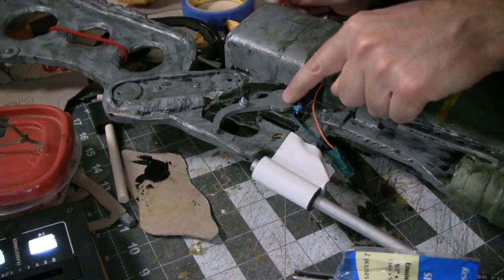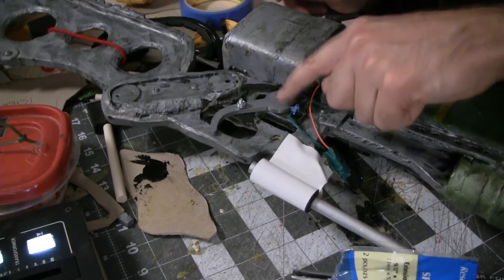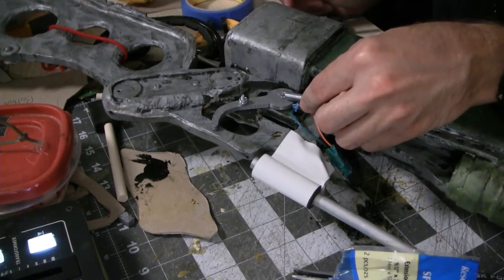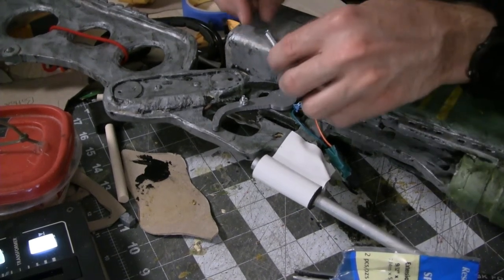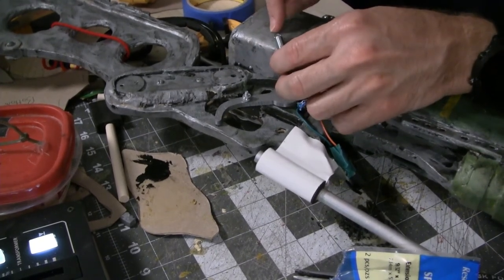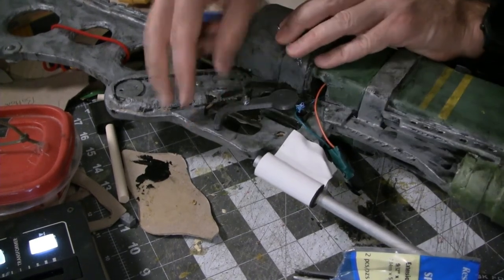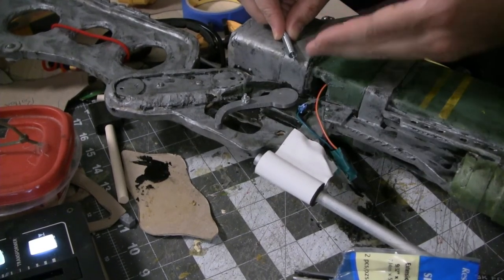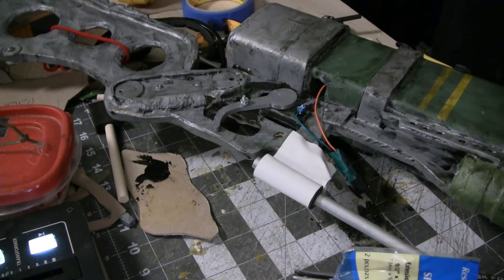Here's what I'll do: go back and modify the model, flip it so it's the right direction. Instead of having a little 3D printed post, I'm going to run a small bolt through it and use that to secure the spring into the trigger. The spring will need to be anchored somewhere — I might just have it up here for now and find a way to anchor it to the final 3D printed part. When I pull the trigger the spring will be extended a little, and when I release it'll pull it back, close the switch, and turn off the firing mechanism.